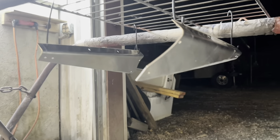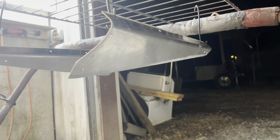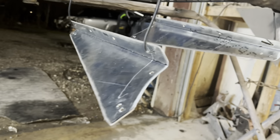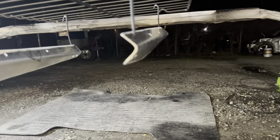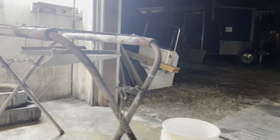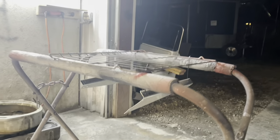Here's what we got - our wing supports that we're going to powder coat. These are supports we made for the drag wing, and we're going to use the Harbor Freight powder coater. I'm not great at this but I'm going to show you how I do it. I've done my seat brackets in my Comet with powder coat and they turned out pretty decent. All you got to do is get a ground hooked up, get the air pressure right, and then dust on the powder - that's the gist of it.